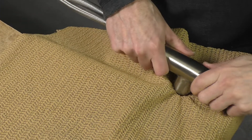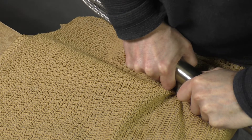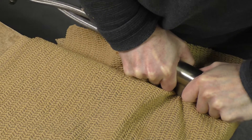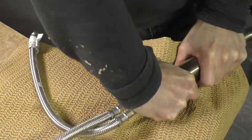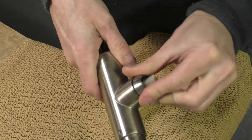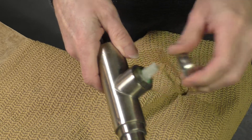I can take the fitting and put it into the hole I originally created. This allows me to put all of my weight on top of it — I've got a high friction surface there, and by pushing down I can turn and loosen off that decorative bushing. Once I've got it loose I can use finger strength to take it the rest of the way off.